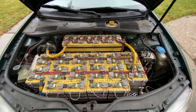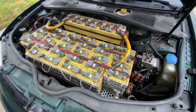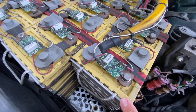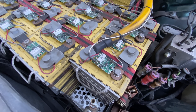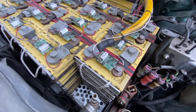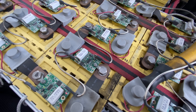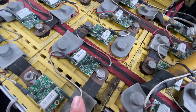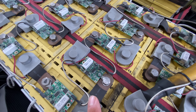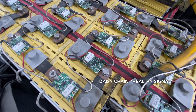Here's a look under the hood — it's a little grungier than it was 10 years ago. These are more battery management boards; these are individual boards on each cell, as opposed to what I had in the rear which was one circuit board connected to many cells. The circuit's the same, just a different package. You can see the series healthy signal — if one battery is out of range the series circuit will open and shut the charger off or sound the buzzer.